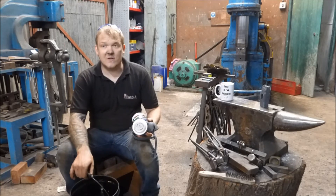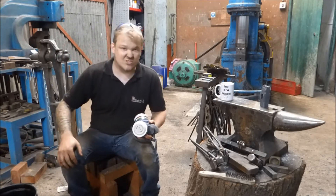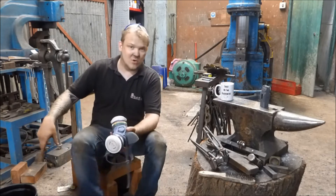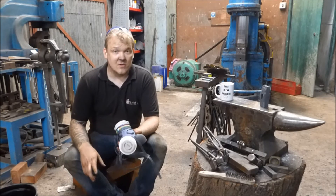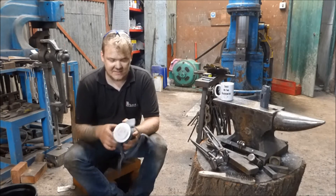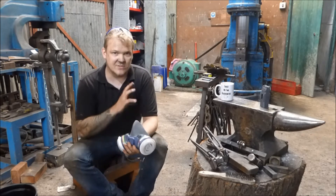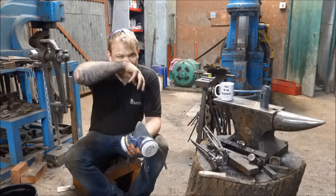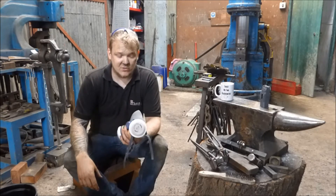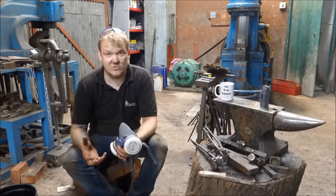It's to do with the quenching medium I used — this old oil. It's just thick oil used in mechanical machines. I didn't explain the health and safety issues behind using oil in the workshop. Adworks pointed out that used motor oil may have some health implications if you use it as a quenching medium.